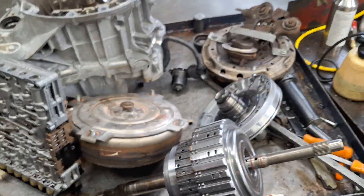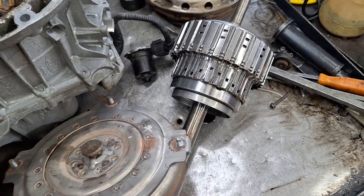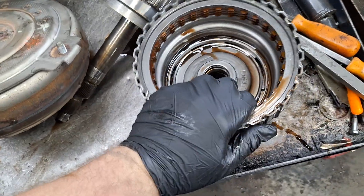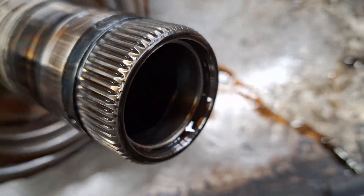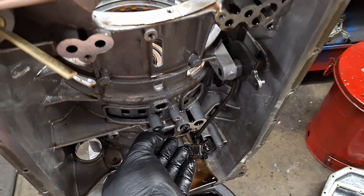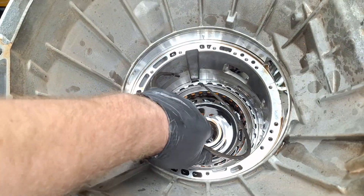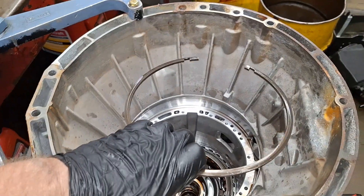Here's what's left in there and here's what just came out. There's a clutch back in here, some Teflon rings, and there's a bushing inside of there — make sure it's not damaged. Make sure these feed tubes are slid out so they don't catch on the center support. I need this giant snap ring out of here using some big pliers.